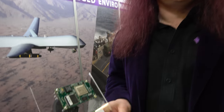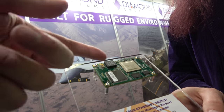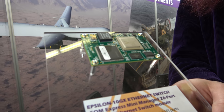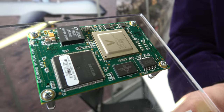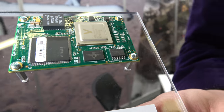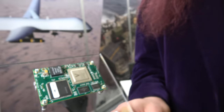The nice thing about Ethernet is that they can create VLANs on the switch, giving them dual redundant communications networks. The software can partition the chip's ports into different groups, so you can have a signal in two different sections that don't interfere with each other. It's virtually like two different switches on one physical device — the same concept as a virtual machine on a computer.